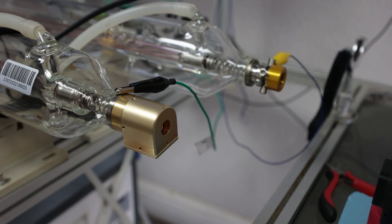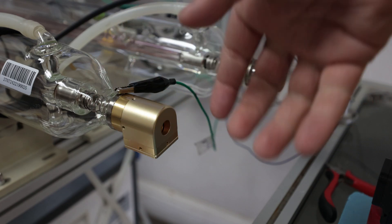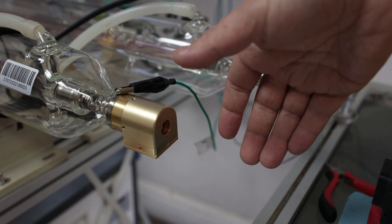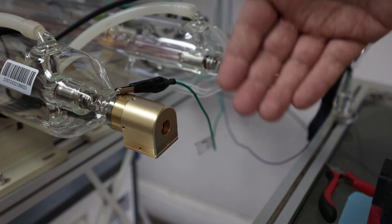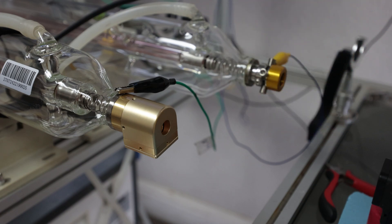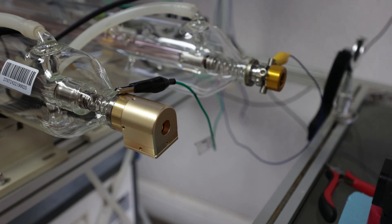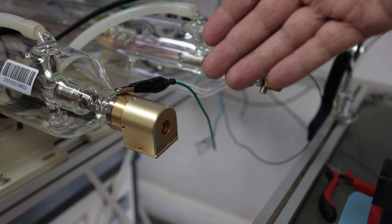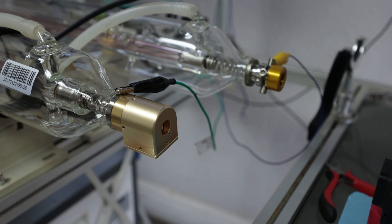Over here we have the two different heads of the lasers. In the front is the SPT, and it looks a little extra bulky because SPTs have an option to come with a pre-installed beam combiner that fits right on the nose of the laser. So you don't need to worry about combining your beam somewhere else in the system, which is extremely convenient. The downside is a slight reduction in peak power. These are both 100-watt tubes, but the JK is going to peak around 120 watts, whereas due to the beam combiner on the SPT, you'll see more like a peak of 105 watts. If you're upgrading something like an OMTEC red-and-black machine, that's an easy trade to make — but if you really need the extra cutting power, you may want to consider the JK instead.